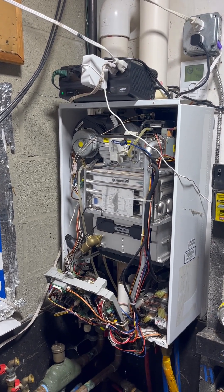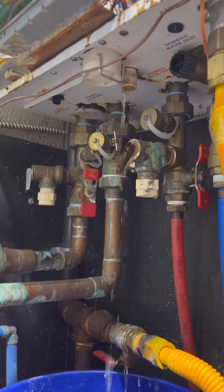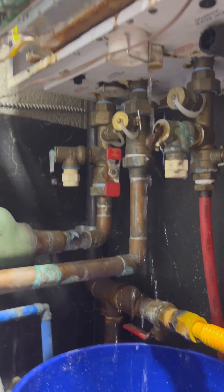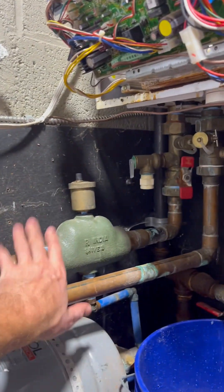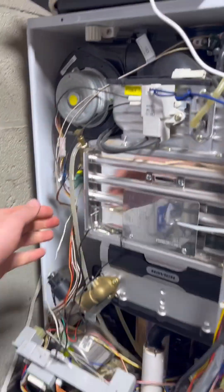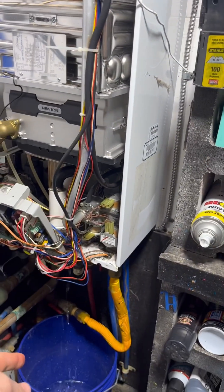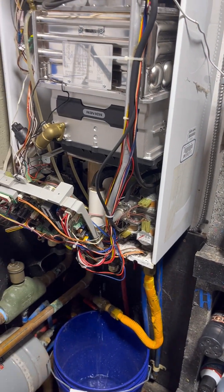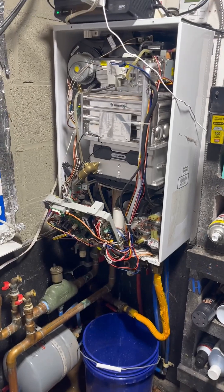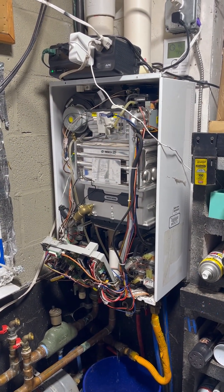You see this leak — this is coming out of the condensate line down here. I'm lucky that the filter popped off so that I could witness this. I'm not getting heat out to my radiators; this is getting hot here but it's not coming through the pumps. I have a ton of water coming through this, and if I pinch that you can see it will come out elsewhere. That's where, when I turn this thing on, the water just pours out — and it's hot water. If I run the hot water, that water will come out steaming hot.